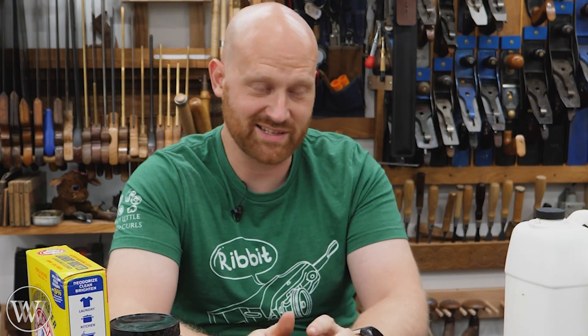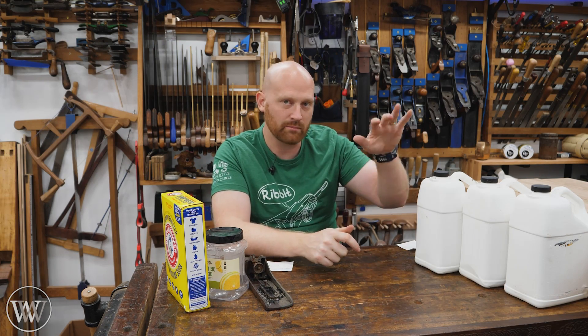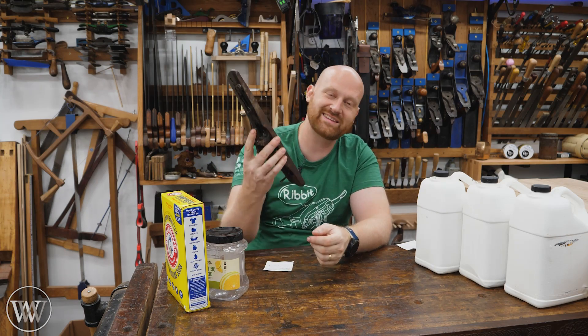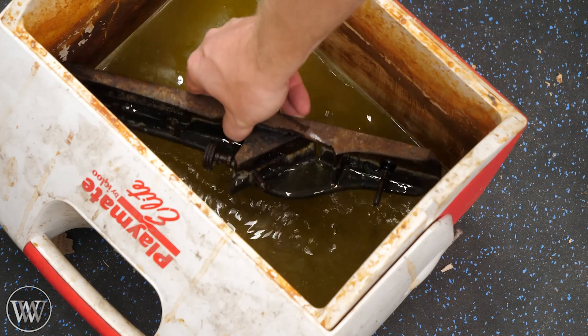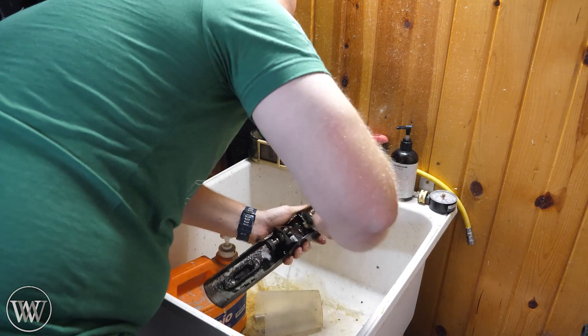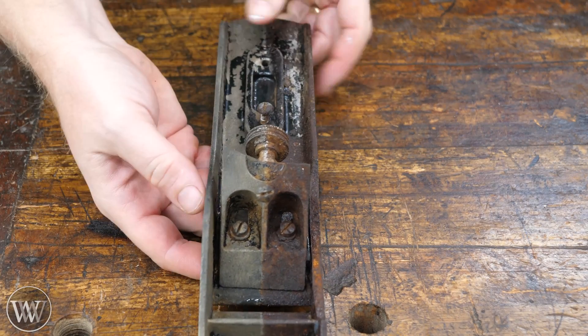The question is, does it work? In Beyond Ballistics' video, he goes into a lot more testing — go check out his channel for that. He showed that not only does it work faster and more efficiently, but you actually get more rust removal per gallon than you would out of Evapo-Rust. I thought there's no way that can actually be true. So I went and found the most rusty thing in my shop and dunked it in the bath, putting it half in and half out to see what comes of it. After 24 hours, we pulled it out, rinsed it off, and scrubbed it off. I used the same wire brush on every spot — on the rusted side and the non-rusted side — so you'd get a direct comparison. And I was really blown away.